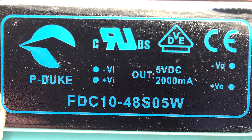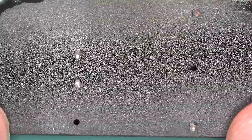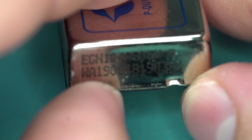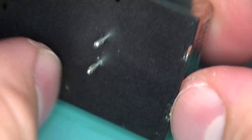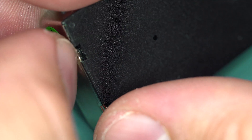This little DC-to-DC converter seems quite nice. It can handle anywhere from 10 to 48 volts in and has a 5-volt 2-amp output. It's pretty simple too — just two input pins and two output pins, needs some capacitance on the outside, and it's completely isolated. Up to 82 percent efficiency — not a bad DC-to-DC converter. I was considering opening it up for science, but the steel they're using is quite tough and I'm afraid if I bent the little notches out it'll just break the plastic backing. I tried to pry it with a screwdriver and it didn't want to budge, so it might take some destructive force to open it. I think I'm just going to leave it — it's a pretty decent DC-to-DC converter made by P-Duke.